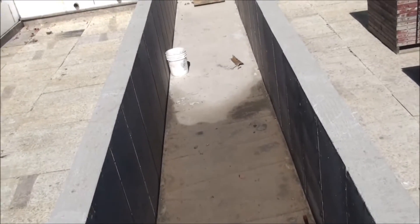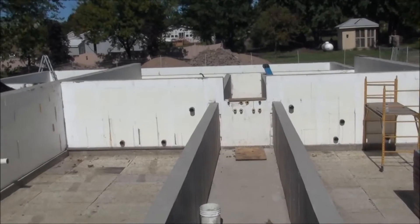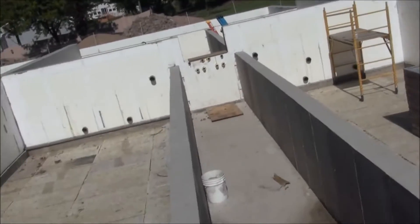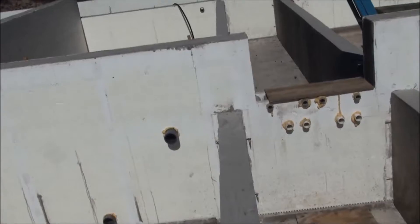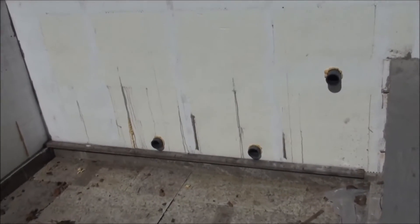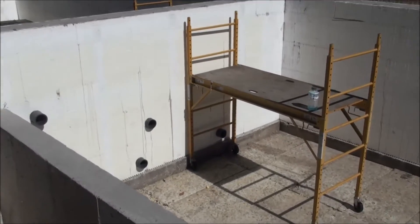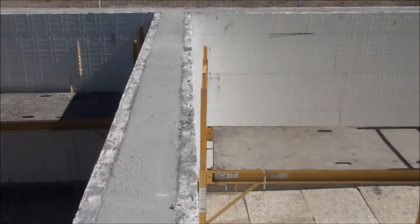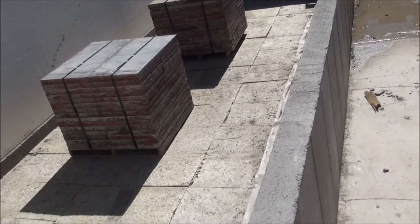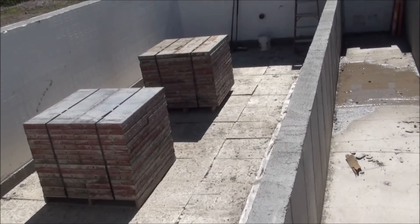This center area, which is just over four foot wide, will house all the 275-gallon water totes. There'll be 18 of them going into this section of the building. And there are penetrations in the wall for airflow in between large thermal mass stone beds. On either side of the water totes, that'll be four feet deep, 12 foot wide, and 39 foot sections — two of them — of washed stone. That will be the thermal mass that's going to have heat retention and cooling retention that'll radiate up through the floor.